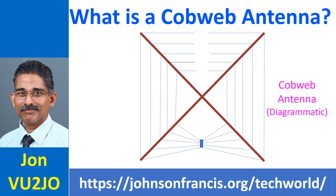Cobweb antenna gives reasonable performance at even 10 feet height, though 20 feet height is desirable. Another advantage is that as it has the appearance of a washing line, acceptance by the ham's family is good. As the dipoles get folded into square shape, impedance is around 12.5 ohms and needs a 1-to-4 current balun in the terminal box. When a current balun is used, no additional choking on the coax is needed.